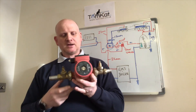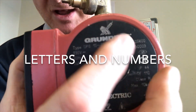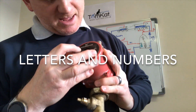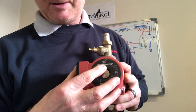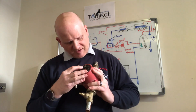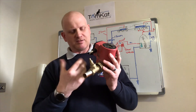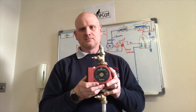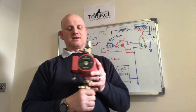For ease of replacement and maintenance, if we look at the front of the pump you can probably just see some letters across the top — it reads UPS 15-50 130. The 15 means the size of the bore coming through here, so they can be a 15, 25, or 35 — that's the flange size. The 50 means it's five metres head.